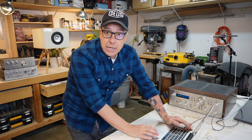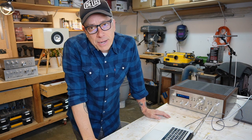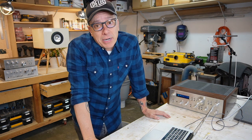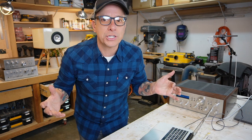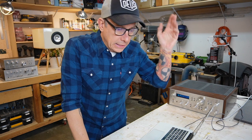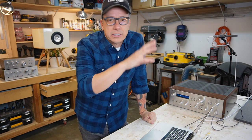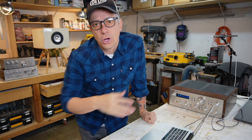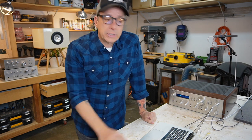Okay, we're in the garage, you guys know already. Ideally, we should be using an anechoic chamber, but I don't have one. I guess just a few people have one. An anechoic chamber is a chamber where the audio just dies, there's no reflection. Because pretty much everything we hear from a speaker is reflection from the walls, the ceiling, floor. We hear a lot of reflection, 70-80%, whatever. So if you want to hear the speaker only, then you go to an anechoic chamber. So we're kind of improvising here. But the thing is that we're gonna adjust the speaker to our environment. So that's our first curve.